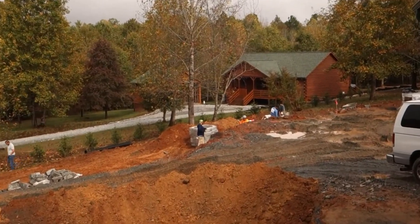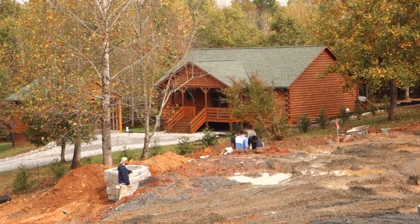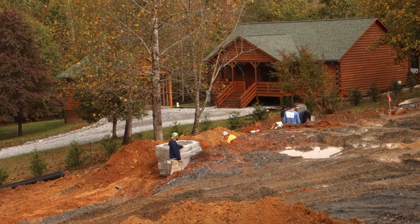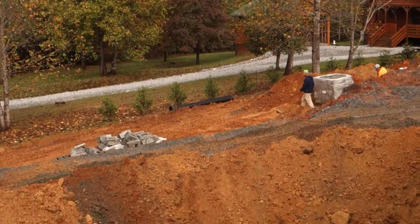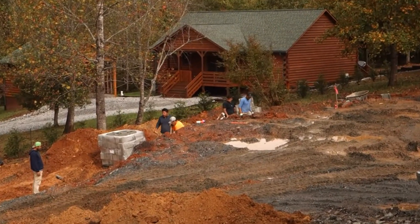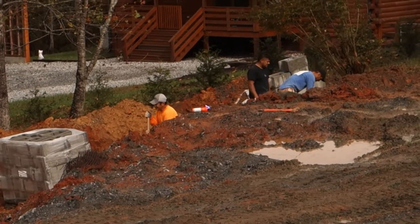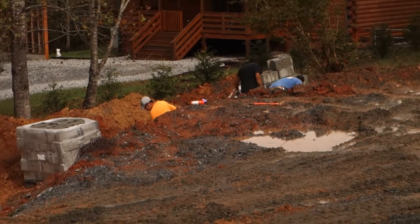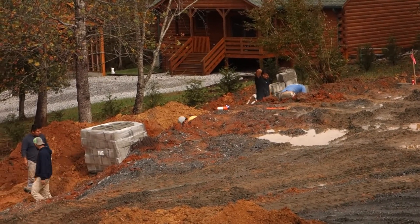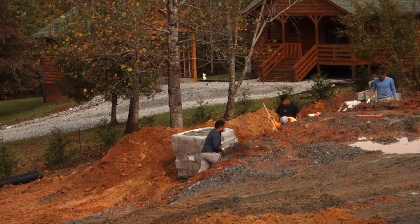This is about midday. What have we got going, Don? They're working on the block, stair-stepping it down this way. At the foundation? They're above the foundation. They've started at the high end and stair-stepping this way. The block will be level to eye view, but the way they're building it, they're stair-stepping down at the ground level because the ground changes. And then bringing in dirt to fill in this area. It's too muddy to get down there — we'll get a view at end of day.